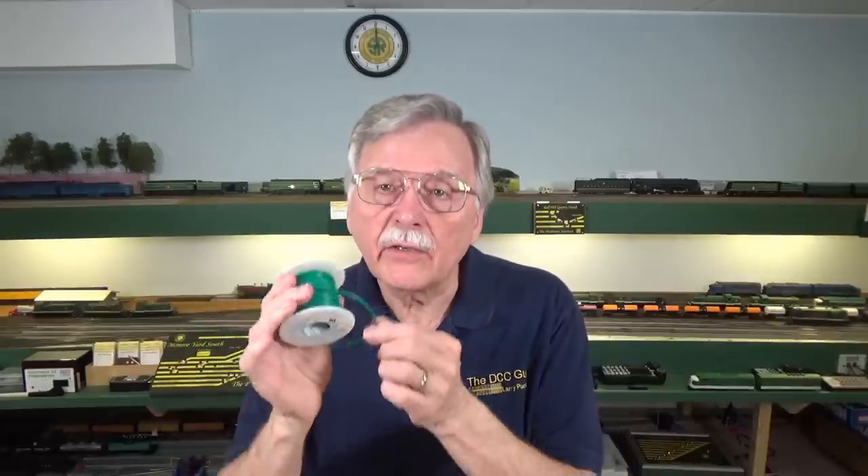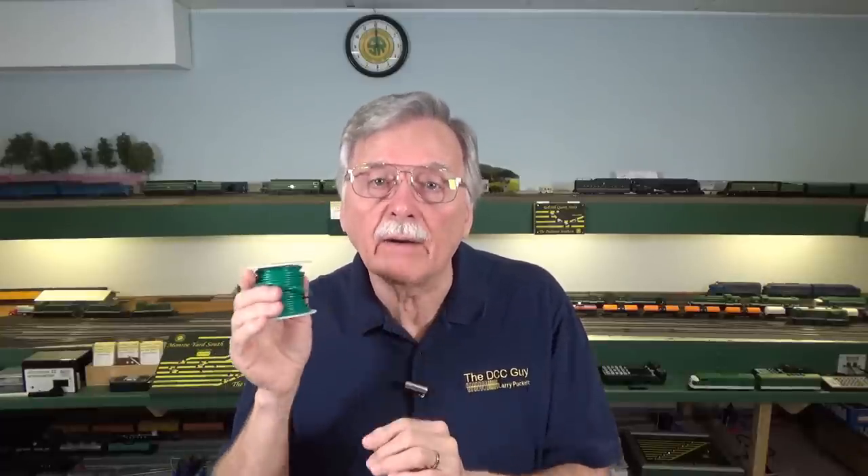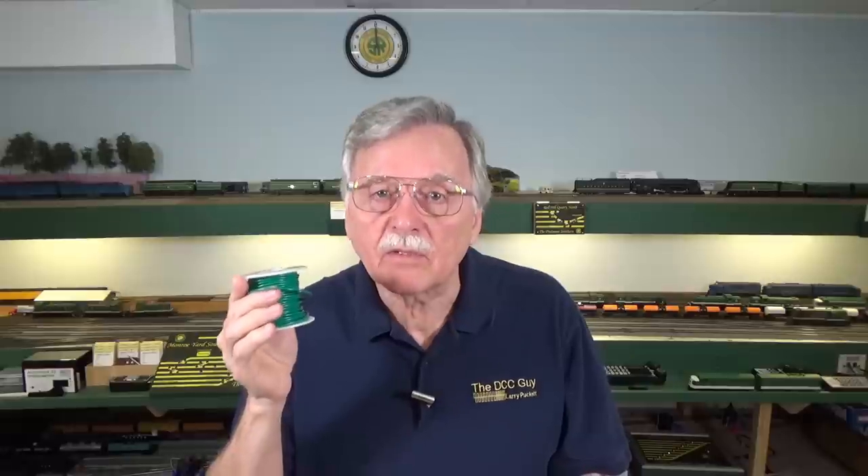For smaller scales, you can go with much smaller wire — this is 16 gauge insulated wire. You can use either stranded or solid wire, and the suitcase connectors I use can generally be used with either. If you go to the 3M website and look at the IDC section, they tell you whether different sizes and types can be used with stranded and solid. In most cases, because of the low voltages and amperages, they can be used with either.